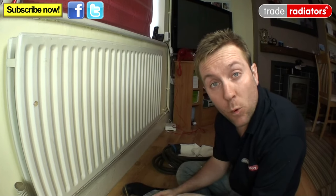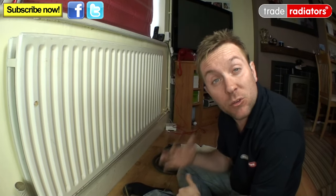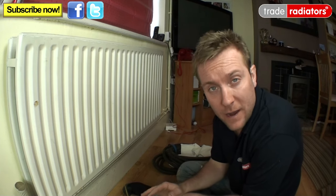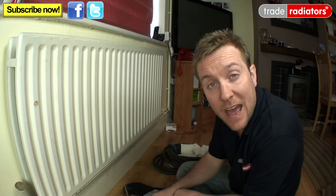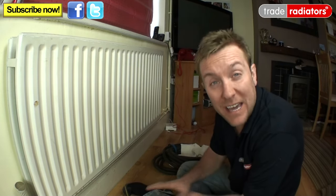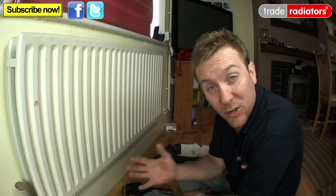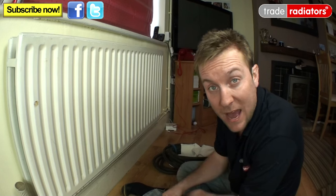The first thing we do is shut off the water supply to the heating system and also electrically turn everything off. Make sure your programmers are calling for no heat, make sure your room thermostats are turned down, and make sure the system is not going to kick in at all. If we have a dry system when the pump turns on, it could burn the pump out and we could also overheat the boiler.